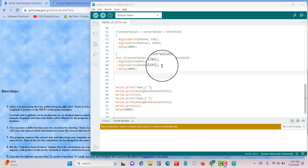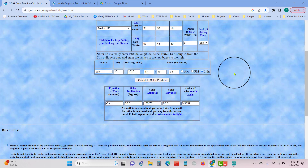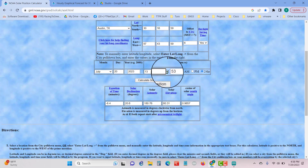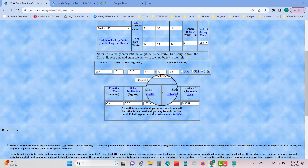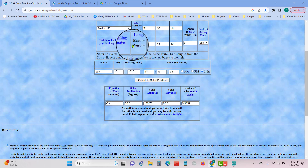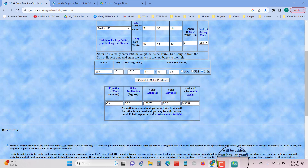To test and verify this is working correctly, you can go to the NOAA site — get your city and it'll tell you what your solar elevation is. At 13:35 the solar elevation was 80.31, going up. At 13:36 still going up. At 13:37 it's starting to go down. So at 13:37, plus my threshold of 50, it has to go 50 points past — not 50 minutes, just the actual sensor value. My sensor value at zero is 300 and goes higher from there. When it calculates the solar position going the other way, it starts retracting.